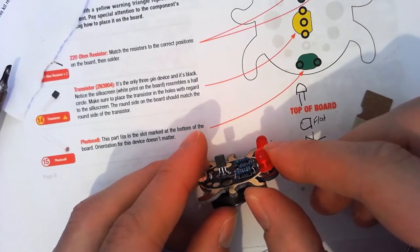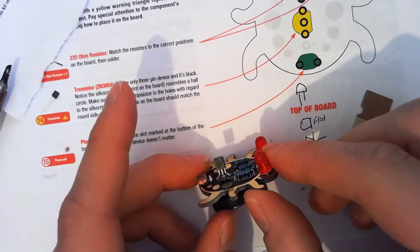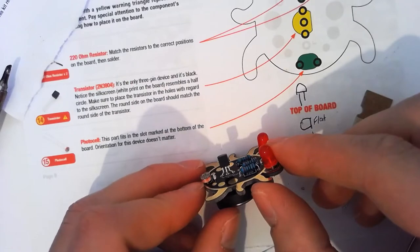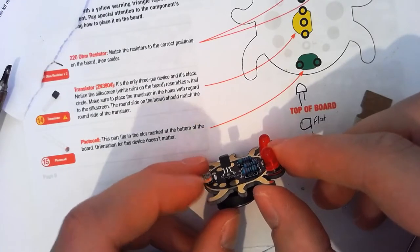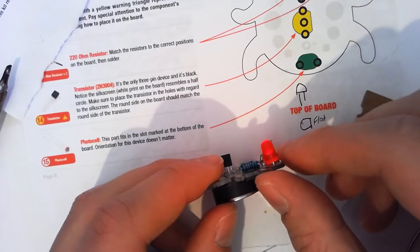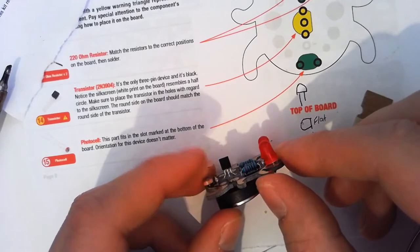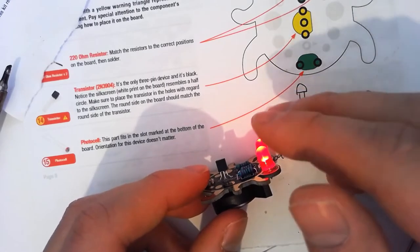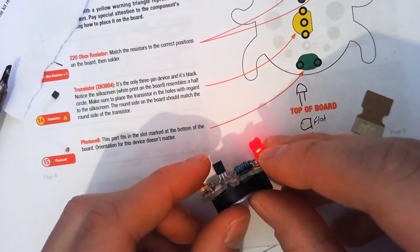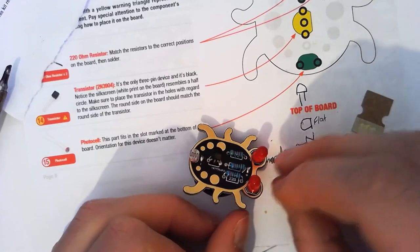So that partially on is how we can use these as an amplifier, so they're not always just on, off, on, off. If they were on, off, we wouldn't be able to get nice sound out of our phones, to our earphones or speakers, or radios in our car, because everything would either be on or off, like a buzzer, not a speaker. We can get those movements in between. So cover up, we get nice bright lights, partially we can get some, and then bright, we're getting nothing.